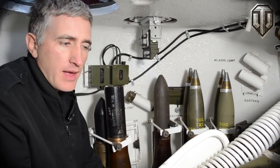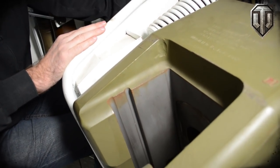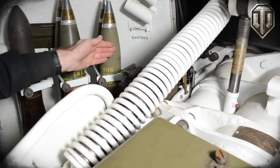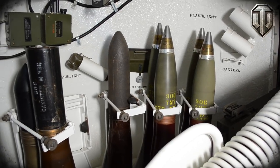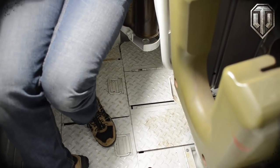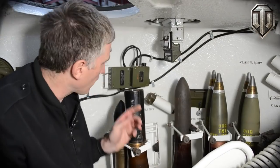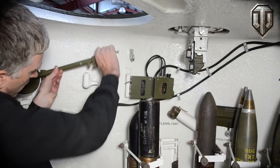The loader's purpose in life is servicing the guns. The 90mm M3 is percussion fired and uses a manual breech, although the breech block has been removed from this particular gun. To its left is the .30 caliber coaxial machine gun. Behind this is a ready rack, which consists of 10 rounds of immediate-use ammunition. In the event that the 10 ready rounds are expended or there is a lull in combat, additional stowage can be found in six compartments under the hull floor. He also has, just behind him, a pistol port.